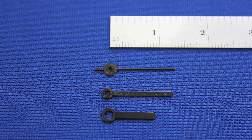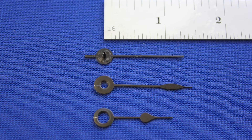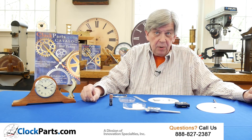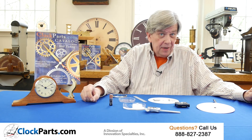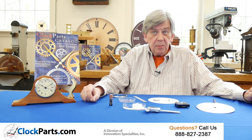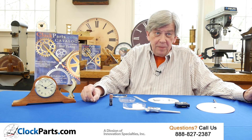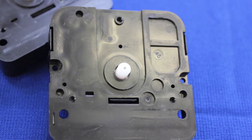We have two short sets of black hands that we offer for the short shaft motor. We also list the dimensions of the mounting holes in the hands. Do not assume that any round press-on hands you may have will fit — you'll need good calipers or a micrometer to check these measurements. Unfortunately, all these parts do not have standardized mounting holes.